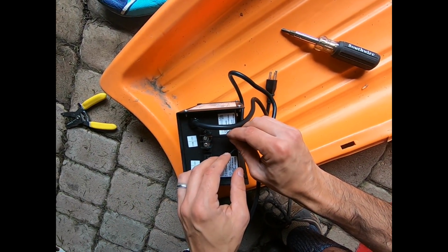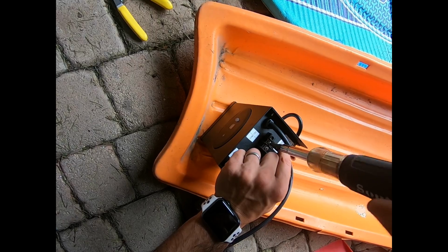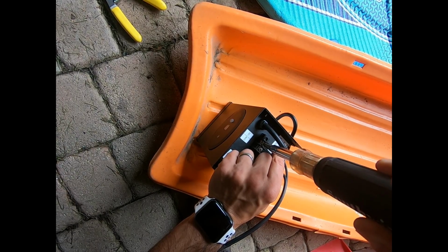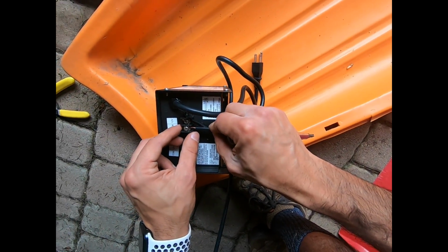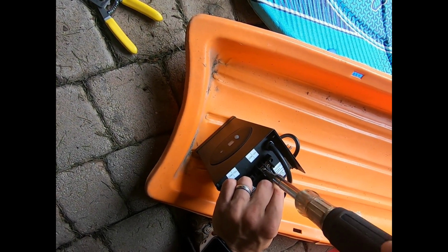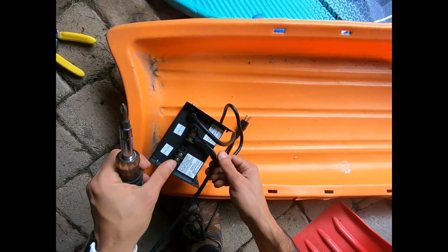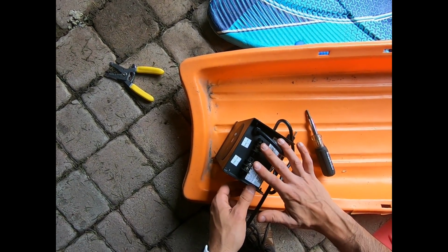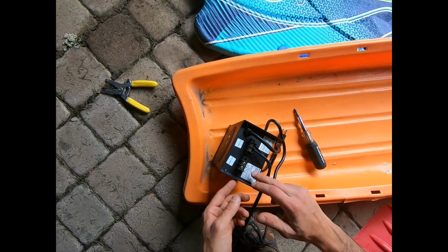And all this is a screw down connection. So you put your wire through and you screw it on tight. You don't have to over tighten it, as these stranded cables, wires are very gentle. Okay, and just give it a gentle tug. Make sure it's not going anywhere, and that's good to go. Doesn't matter which one of these to use. This basically just has two outputs, so you can set up another circuit on here.